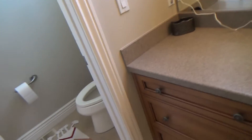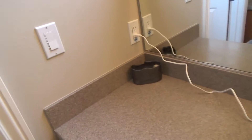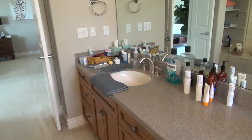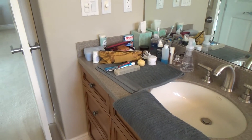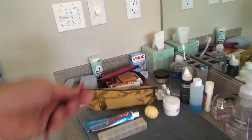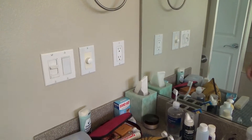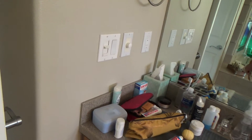With GFIs, in a bathroom you don't necessarily need a dedicated circuit for just one outlet. You can connect usually like two bathrooms together. So we've got three electrical outlets — this one here, that one there, and one in the other bathroom. Those are probably on a 20-amp circuit, not a 15-amp circuit, because you might have a hair dryer, curling iron, radio, or razor. Have you ever overloaded something and it clicks off? That's because the GFI might be located in another bathroom.